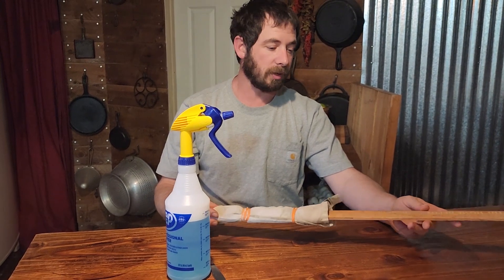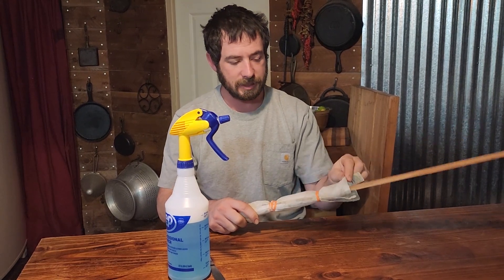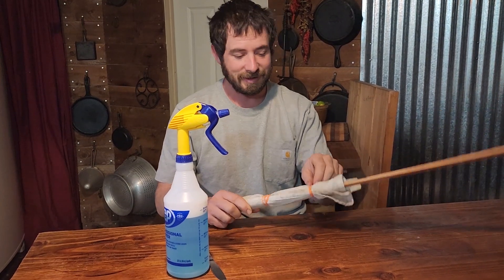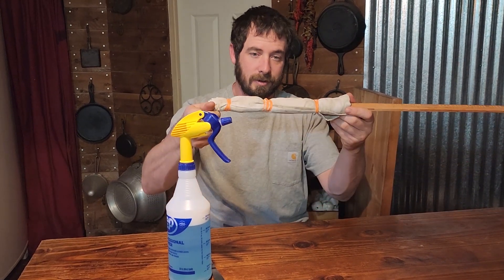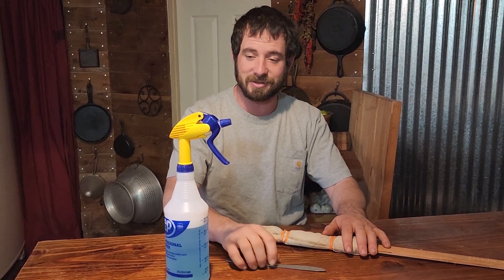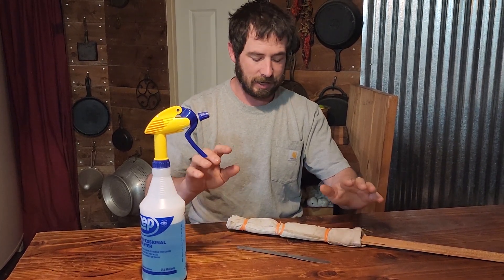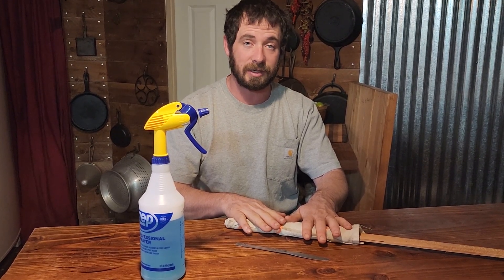Today I'm going to be showing you with five easy items how to clean that. You're going to need a yardstick, a flour sack towel — or just a towel that you don't want to save because after this you're not going to keep it. A couple of rubber bands to hold it on the yardstick. You'll be wrapping it around that, nice and narrow so it can fit in there. A butter knife or flathead screwdriver to loosen the hinges. And some Dawn dish soap and water in a spray bottle — you're going to wet the cloth with the Dawn dish soap and clean out between the panes.